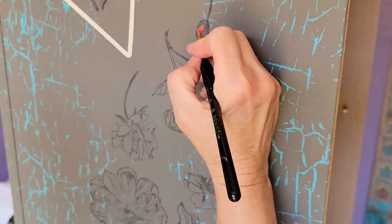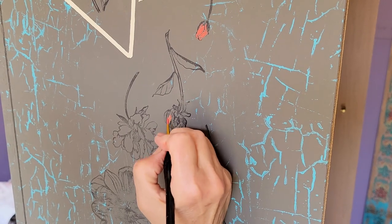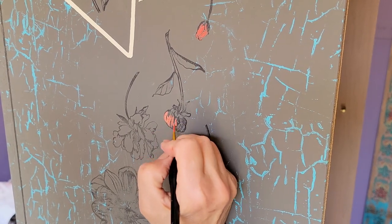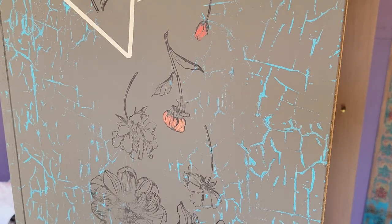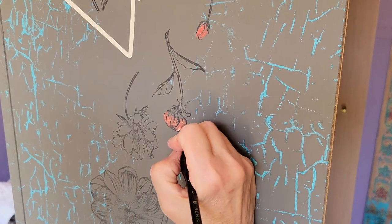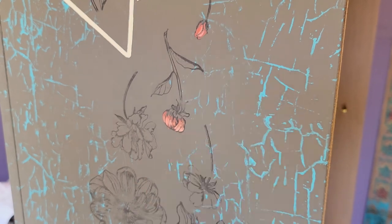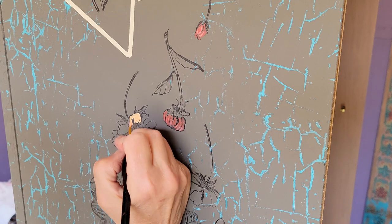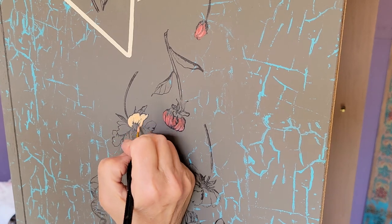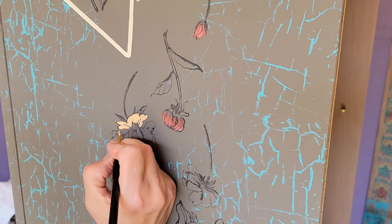Now it's going to get fun. Now you can paint in the lines. And I use some Dixie Belle paints mixed with some acrylics to either lighten them up or darken them up. And at this point, if you want to, I'm adding a highlight there. A highlight is something that's maybe closer to you or more on the surface, because we're going to go back in and stamp these again. And when we stamp them again, we're going to add the black back in for a low light. So it just works really cool and it's really neat.